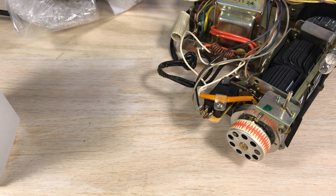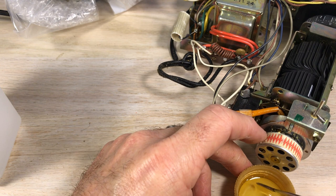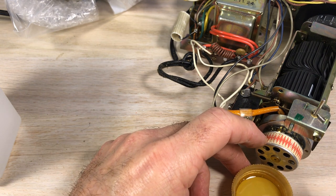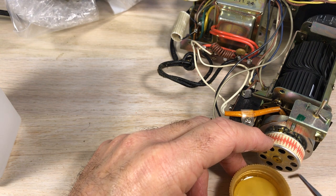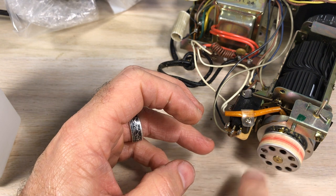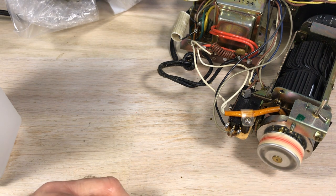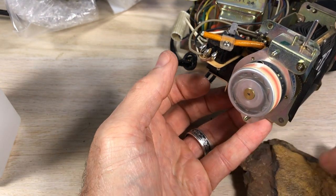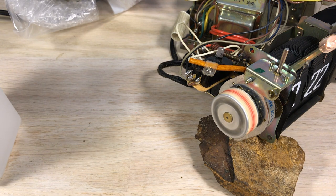I've got a capful of this synthetic oil. You can't just pour it in, so I'm going to get a feel for the consistency — compared to the other stuff it's fairly thick. I'm going to get a drop and aim it behind the hole to drop down where the axle is. There's a simple shaft just on the other side of the metal. Once it goes down and hits that area, I'll give it a few spins. I can feel the resistance — it's getting down in there. I'll energize and just let it run and work its way into the whole situation. I might prop it up so the oil has more tendency to run the length of the axle — using my little piece of rock from the Great Smoky Mountains in Tennessee, which is actually illegal to take out of the park, by the way. We'll just let it sit and do its magic.